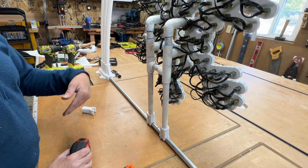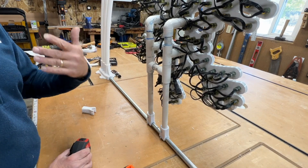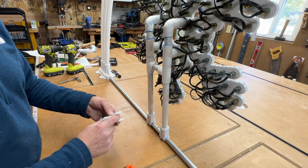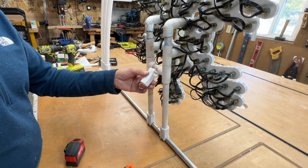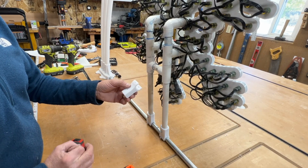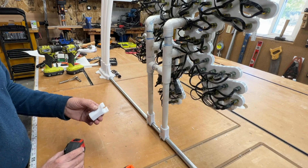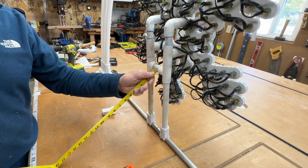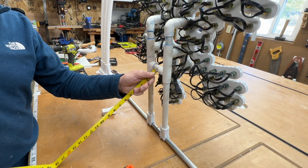The next issue is this is going to fall over in the wind. We've got quite a sail from the snowflake when the wind hits it head on. So I'm going to use this piece — a half inch PVC to half inch EMT fitting. It'll clip in this position, and I have a piece of EMT that'll be bolted in position with an M4 screw. On the bottom of it I'm going to have a larger hole for a standard tent stake that I can drive into the ground to keep it in position. Measuring from here to here, that's about the right angle — about 18 inches, a foot and a half. So I'm going to cut a piece of EMT a foot and a half long.